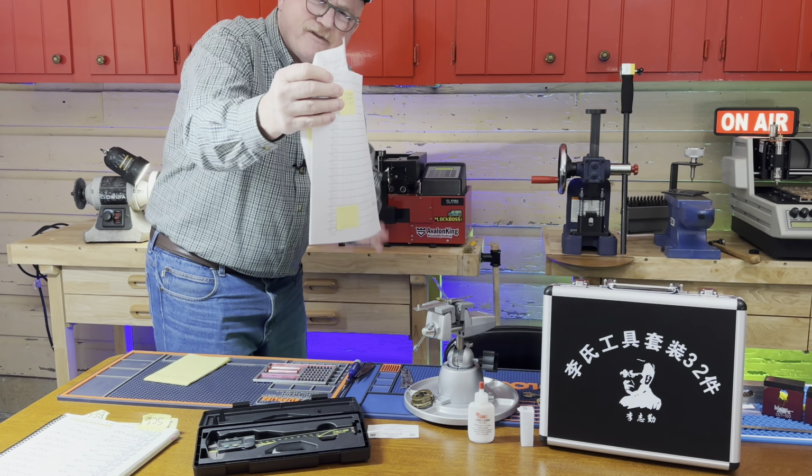See the difference between two cylinders pinned identical? I mean, I meticulously pinned these. I put in new springs. I did everything in these old cylinders. Funky. Oh, that's as smooth as butter. I mean, we're talking butter here. So sometimes you get a bad cylinder. This was bad though. I can hardly get the pick into it.